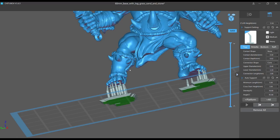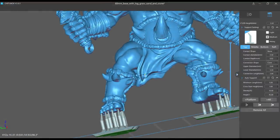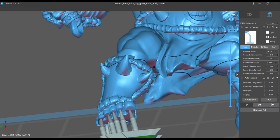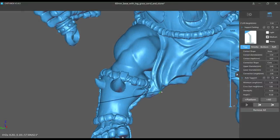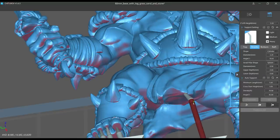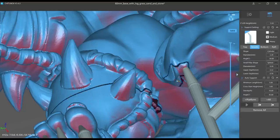My model is now very securely anchored. Now look at the loincloth — it's floating on its own for about 30 to 40 layers before it joins the model. I have to place supports adequate to get that section up to the rest of the model. Since it's on the underside and I can hide any damage easily, I'll go a little thicker to make sure I don't get a flat pancake loincloth. In the big flat parts I can use heavier supports. I'll go back to heavy for this low point and make sure I get the whole island.